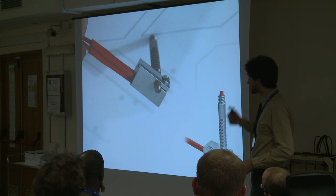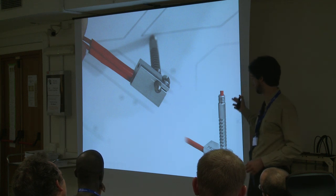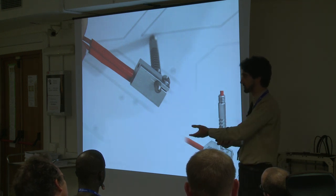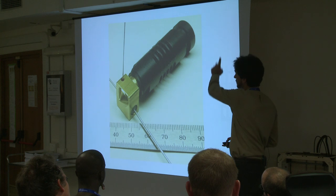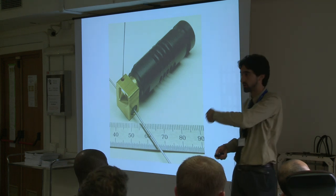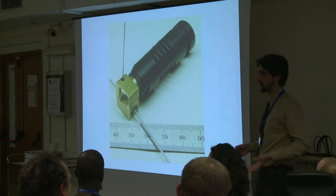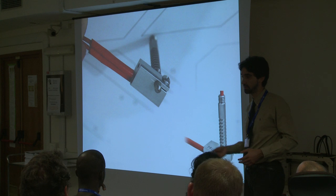This is another idea from Josef Prusa, a stainless steel barrel, and this is able to print materials at higher temperature. This can reach more than 300 degrees, while, for example, for the previous one, the melting point of the material is 248 degrees. So, you cannot print polycarbonate, you cannot print some kinds of nylons, you cannot print other new materials that require high temperature. This is also food safe, being stainless steel.